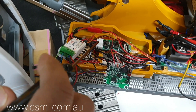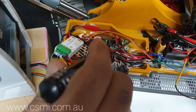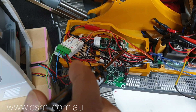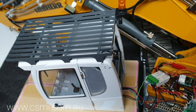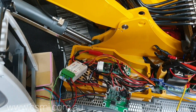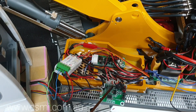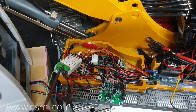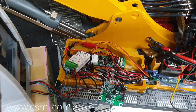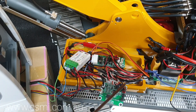Up here there are three circuits. This first circuit is for the lights — all the lights connect to it. You can see there are two ports here; those are the lights for the cab itself — the front light and the back lights. The other two ports are for the lights on the boom and on the car body. This particular circuit is for the digital display screen inside. I also put a servo ML4 to be able to switch on the lights — front of the cab, rear of the cab, inside the cab, and the beacon itself.